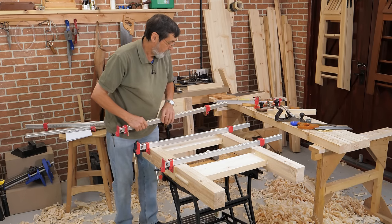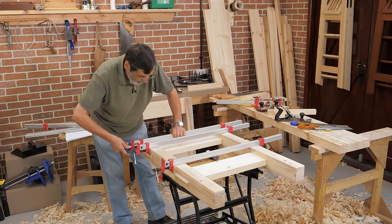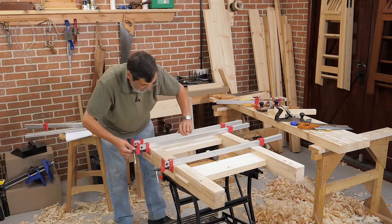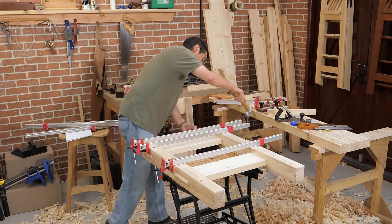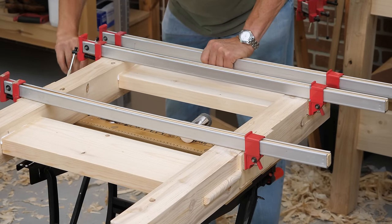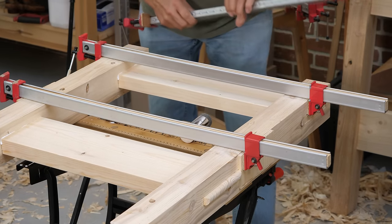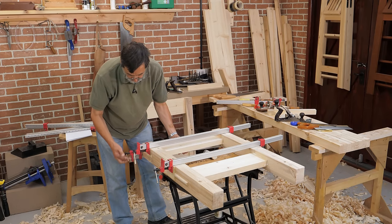This one can come off. I'm going to put this one. Because it's so wide, this tenon, I'm just going to put this on. There's a little gap at this end, so I'm going to put the clamp here. That cinched it nicely. So I'm going to take this off now and put this on the opposite side underneath here to work on the shoulder on the other side,